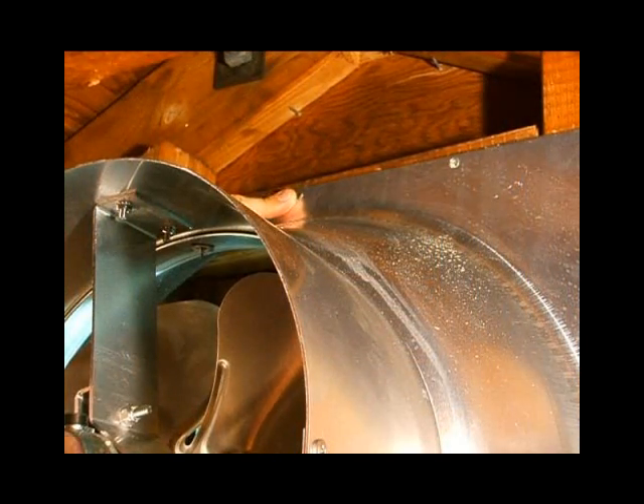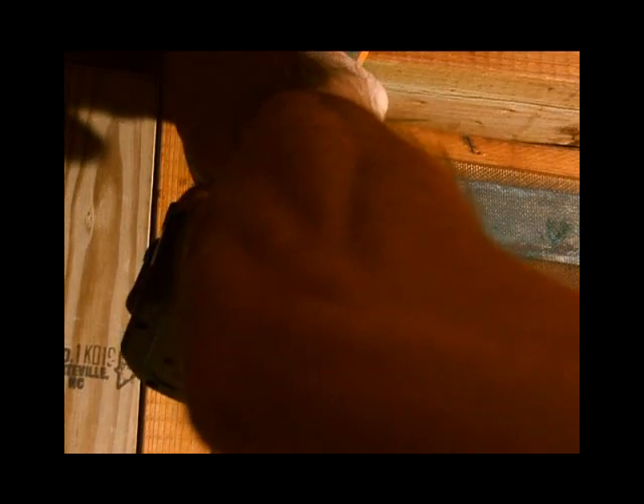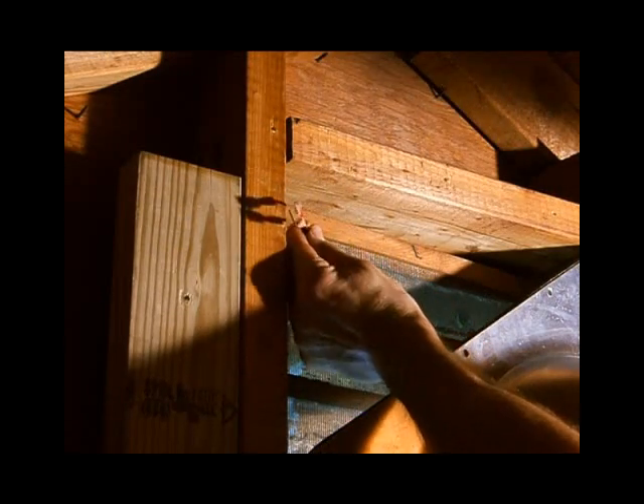Next, I hung the housing in place with a single screw just to do a final check on the fit. I pushed open a small hole in the screen to pass the electric cable through — from there it would go up to the solar module on the rooftop. Unfortunately, I didn't plan ahead carefully. To reach the PV module on the rooftop, I'd assumed I would need to use the long 20-foot cable attached to the fan housing, but as it turned out, the shorter cable attached to the PV module itself was just long enough to reach indoors. So I ended up mounting the fan to the gable wall twice. Not a disaster, but a reminder that it pays to plan ahead. Here's the situation later with the PV module cable coming through the screen.